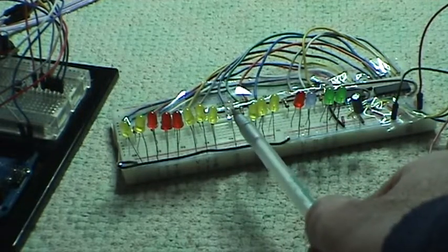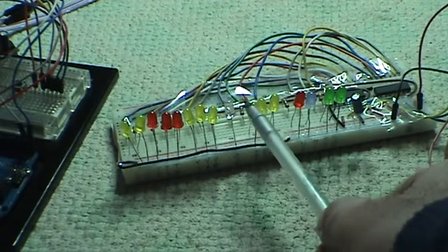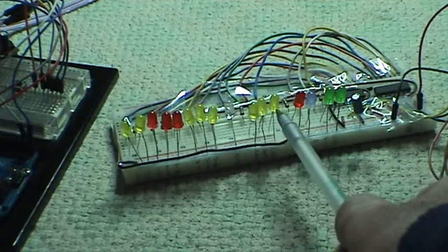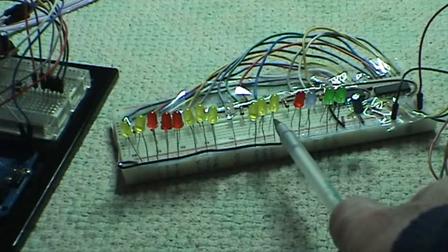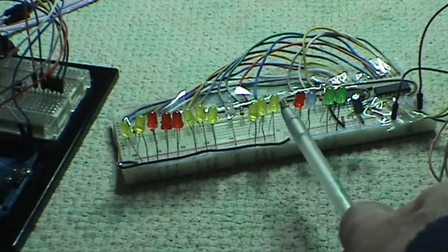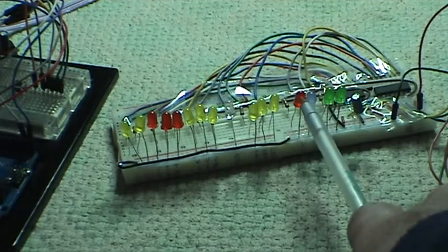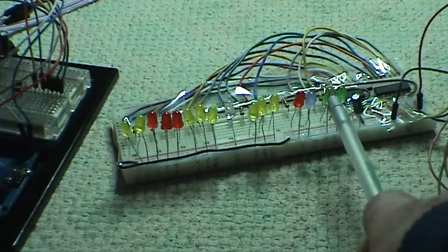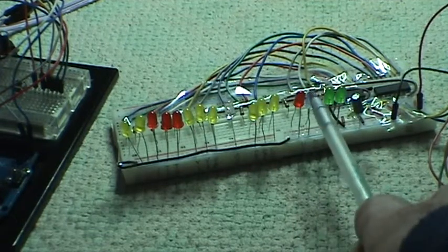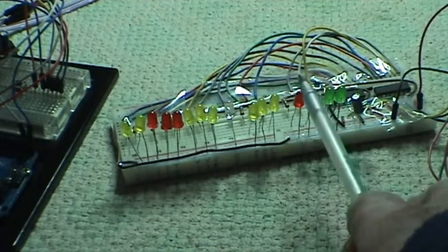Here is the automatic. So when automatic is on, this will be white. Here we have the presets. So we have again binary counting from 1 to 4. There's 4 presets, and then we have the indicators for which of the pickups are active: bridge, middle, and neck, middle, and bridge. Bridge split here, or both, or off.